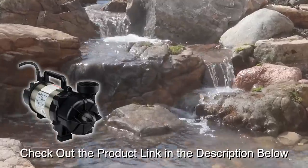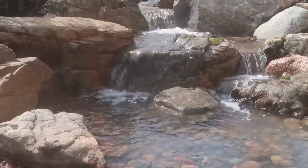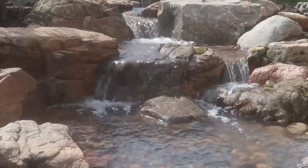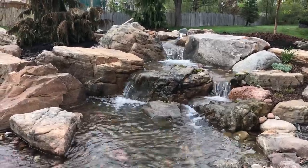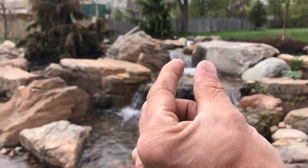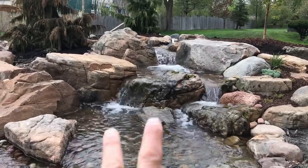This is a 9PL pump and you can just see the amount of water it creates — about 7,200 to 7,500 gallons per hour. Because of the 9PL and the volume of water being pushed, it allowed me to really spread this waterfall out and have nice thick water, more than just a foot wide. It's really important as you're building water features to understand the flow rate of the pump and what you're capable of doing with the waterfalls. With basically seven rocks total — we'll call it five big frame rocks — notice how we are changing the width of the waterfall, going skinny and thick, then splitting it around this center rock. Get creative with it, understand the properties of the rock, and make sure the joints match up — you can really create a lot with very, very little.